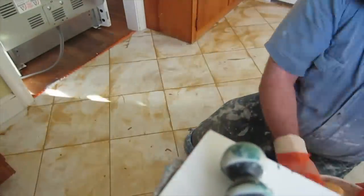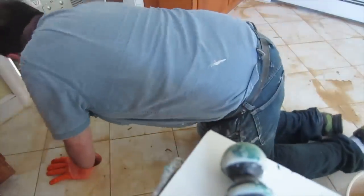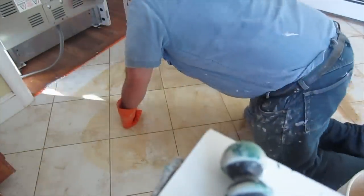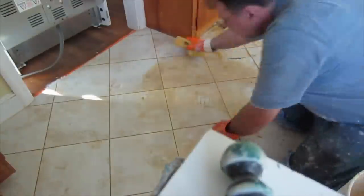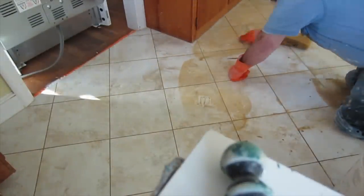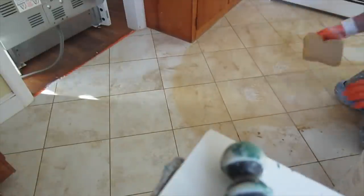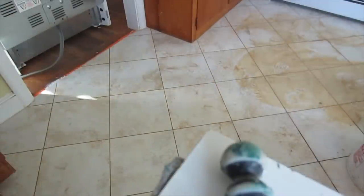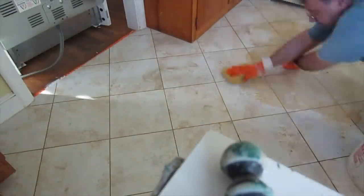So after you've got a section grouted, then you obviously need to clean it up and wash it. Basically, you can use a grout sponge, and you're going to wring out as much water as possible. You're going to wash it once, you're going to let it haze over, and then you're going to rinse it off. And like I said, all these details are in another video I have which goes into great detail, and you can find that in the how-to playlist on my channel.